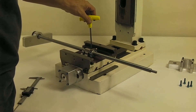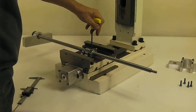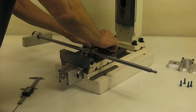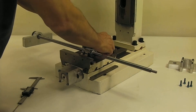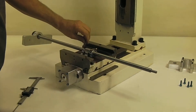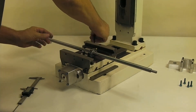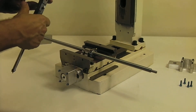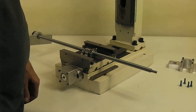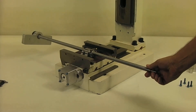It says it's straight. Now the grease zerk on this faces straight up toward the table. If you want to be able to grease it without taking the table off, you have to get an elbow or oil lines — there's lots of stuff you can do as far as oiling. I'm going to probably just put an elbow on it so it sticks out here so I can hit it with the grease gun. Some people like grease, some people like oil. So it's snugged up and square.